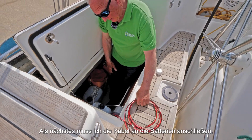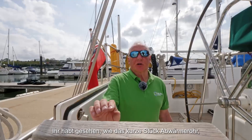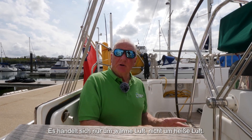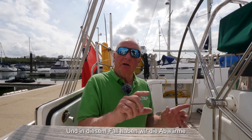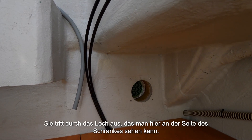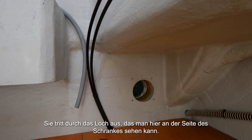My next job is to connect up the cables to the batteries. You saw me positioning that short length of off-heat duct that we put on the fuel cell neatly up against that hole which went in the side of the locker there. The reason for that is to get the heat from the fuel cell away so that the fuel cell doesn't re-breathe that heat. It is only warm air, not hot air. In this instance we've taken the off-heat into the sail locker which is adjacent here and it comes out through that hole that you'll see in the side of the locker.